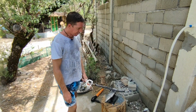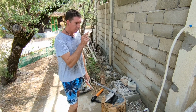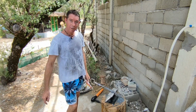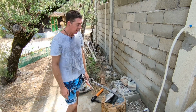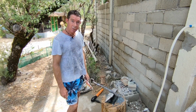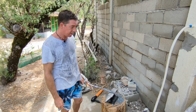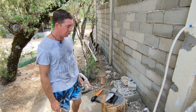It's not completely straight, so I'm going to switch out the anvil for the bench vise. I'll bolt the bench vise down to the stump, turn the forge back on, and go through a process of just slowly straightening out the blade. Once that's done, I'll take the grinder to it, get it nice and smooth, and then we can start drilling holes in it, and then we can look at the heat treatment process, and then finally filing it all down and then sanding it all down to the final knife.